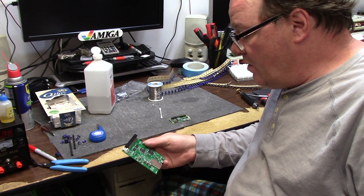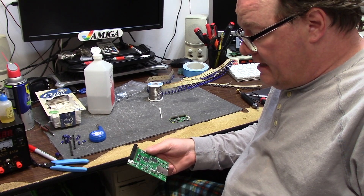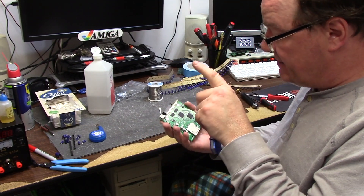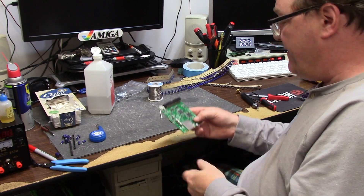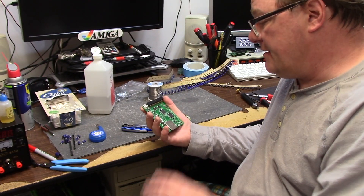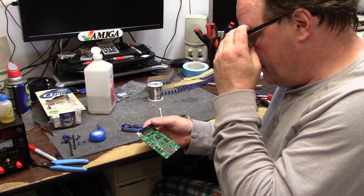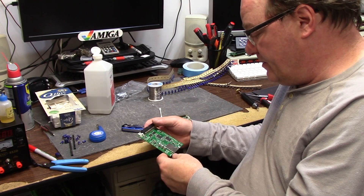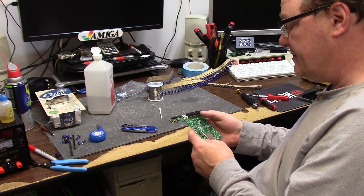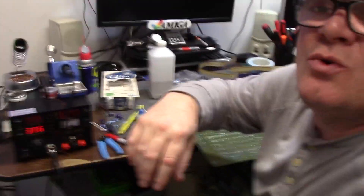Kevin also sent me a SCSI-to-SD version 6 that accidentally received 12 volts — something smoked, popped, and stunk; it no longer works. I can't see anything on it — you think 90s tech is bad, yeah, that's really bad. At the tip of my finger are two capacitors — can't really see them. I also have a busted SCSI-to-SD. If it was the CPLD — just a small Lattice brand chip — if that pops you're screwed. This thing is dead; there goes a hundred bucks.